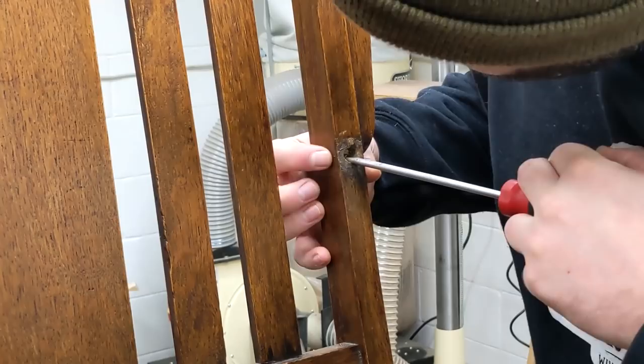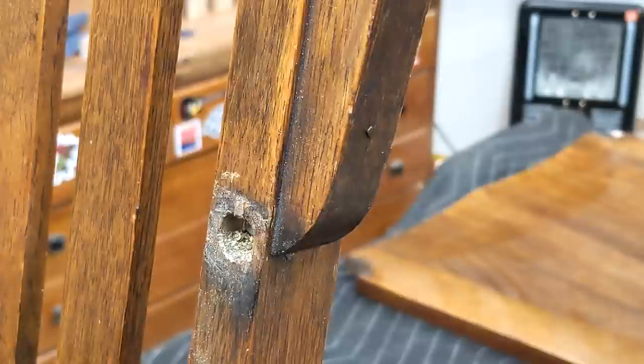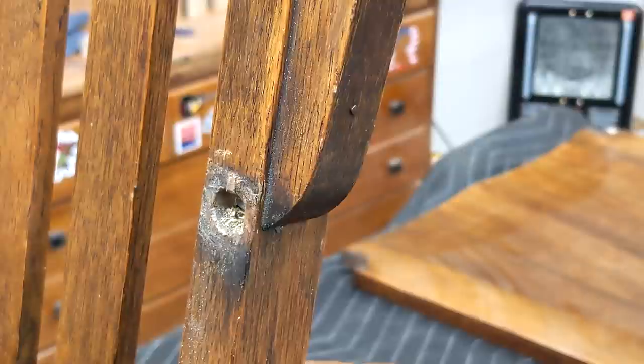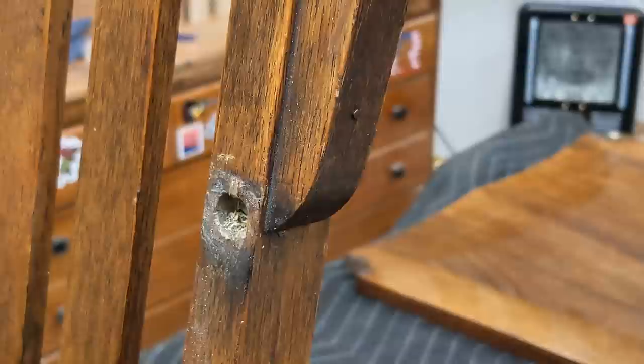It definitely comes from that. Nope, it's from the outside, right underneath that side of it. Why would you do that? Let's look where they put that nail. Down underneath there, and you can see it goes across there. Anytime you're knocking apart a chair or any type of furniture, always watch out for that, because too many times I have forgotten to check if there is a nail going across there, which is very common. And if you're trying to knock it apart, stuff is just gonna explode on you.